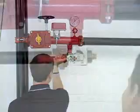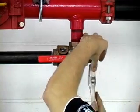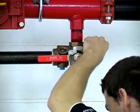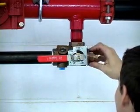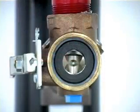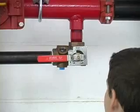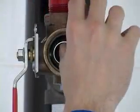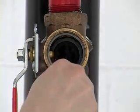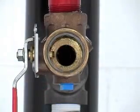Once the section is drained, return the valve handle to the off position and remove the valve's adapter end by turning it counter clockwise. Remove and discard the upstream valve seat. Turn the valve handle to the test position and remove the ball. Remove and discard the downstream valve seat. You may need to use a tool such as a small tack puller to carefully pry the seat from the body.